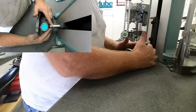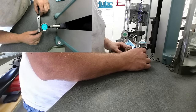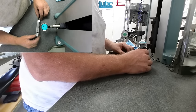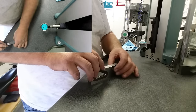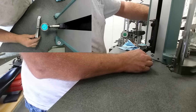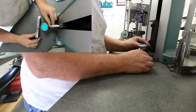Get over here in the corner, and we're zeroed up. And the same thing — look at that. Wow. We're seeing pretty much the same numbers here at the midpoint. Let's go all the way down to the bottom and check there too. If we get repeatable errors down there, then we know it's just a bad grind on top. Zero in the corner — yep, same thing. The side-to-side grind is way off. So we know that this pad is wedge-shaped. That's a pretty easy fix.